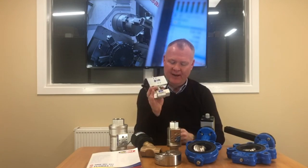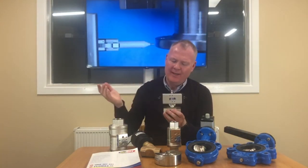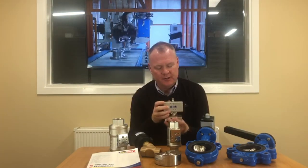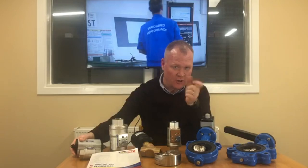We also have available the conventional and very popular actuated ball valve — your brass body, aluminium actuator, but also available in stainless steel body, and you can get it with a stainless steel actuator if needed depending on the environment. Available in single or double acting, and we can also do it with an electric actuator for precise open and close movements or positioning.